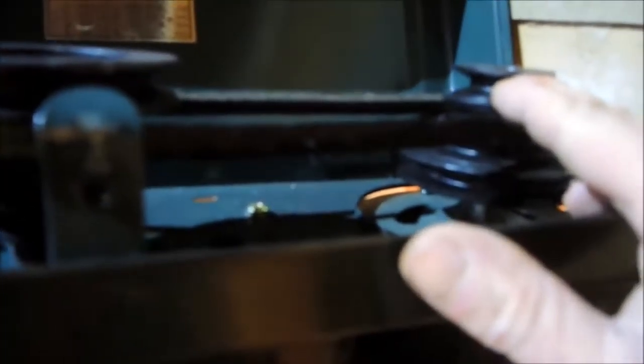Here this drill has 12 speeds, depending on which position these two belts are in. I don't know if it's visible, but here the positions are like A, B, C, D, and this is position C, and here the positions are 1, 2, 3, 4, here is position 4, so the speed is now C4. And here on this table I can see C4, it's 520 RPM. This can work from the first speed, which is 200 RPM, slow and lower, and the maximum speed is 2600 RPM. Here is a really big and powerful motor,